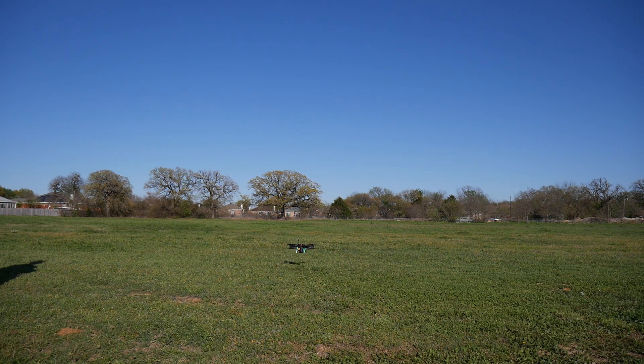The Thick drone is a very powerful quad, and with so little weight on it, if I hadn't adjusted the default throttle idle value there's a good chance it would have flown away immediately on arming. So I set those almost to minimum in ArduPilot for a nice slow idle speed. Then I used the HereLink to view telemetry as I was arming the drone.